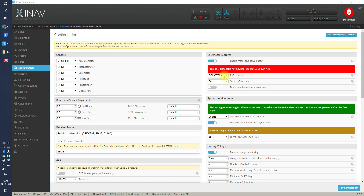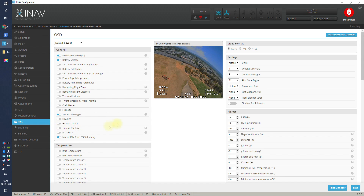Right away, you will not see any result of the ESC telemetry. To see results, we can do two things. One: on the OSD, we can display the motor RPM from the ESC telemetry. The option is in the general section in the OSD — just enable it there. The preview doesn't really show what it is, but this is enough to output the RPM. This is the average RPM from all motors, not the RPM of every single motor individually.